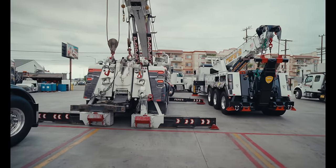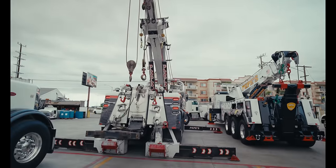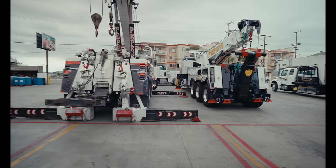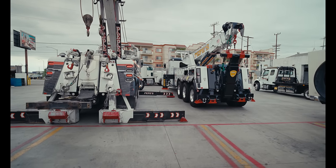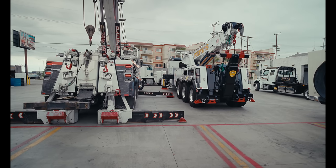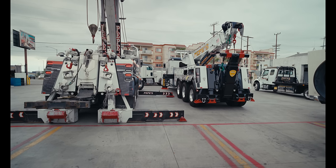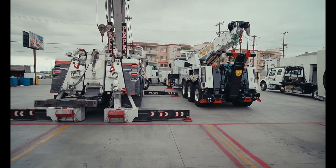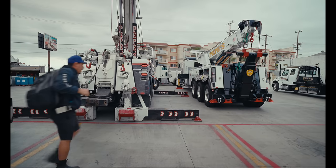The way I'm going to attempt to do this first lift is dual spreader bars - one in the front, one in the back. I don't have an approximate weight on this truck because that cab is brand new. It used to be a single cab without the sleeper. My dad's truck used to weigh 58,000 pounds, so I'm going to assume it's slightly more now.